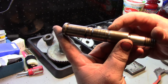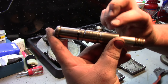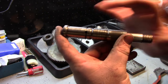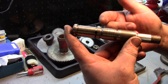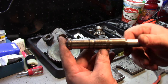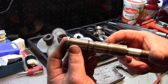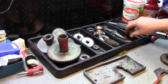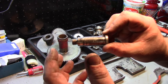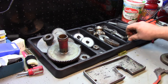And you can see the rolled edges here. I'll mic it here and here, and see if there's a lot of difference in here, and see how the gears fit on there now that there's no grease or anything in the way, and see if they rock back and forth. They do rock back and forth. You know, maybe we have to repair that, maybe we don't. We'll see. We got some scoring on this shaft, which is just for the outboard gear on the banjo. Nothing huge.